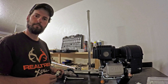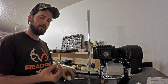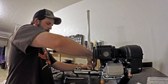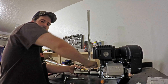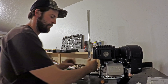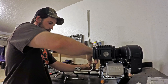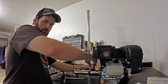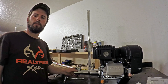Step three: put the grease zerk on. You're going to want to separate these — your cap unscrews. The reason you want to do that is when you screw this in, your cap screws on top and you'll actually tighten that cap to where you can't get it screwed on properly, or you won't be able to get your cap off. Take it off and be careful because the top is very sharp. Then screw your cap on, fill it up with grease, and that way it will auto-grease your coupling.